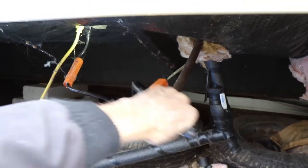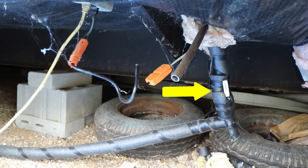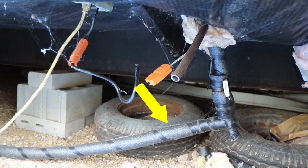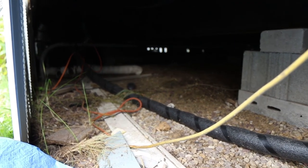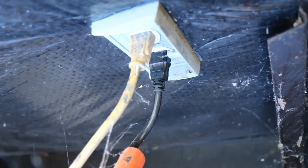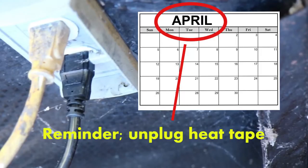Here I'm looking at the heat tape, noticing that it's still plugged in and installed quite nicely. There's Armaflex pipe wrap placed over the heat tape, and then electrical tape is used to secure it. It needs to go the entire length from the home all the way to the water outlet from the city. This heat tape does not have a thermostatically controlled sensor, so it's plugged in all the time, costing you money because it is not cheap to operate. Find a way — through your calendar or phone reminder — to note that you unplug it in springtime and plug it back in during fall.